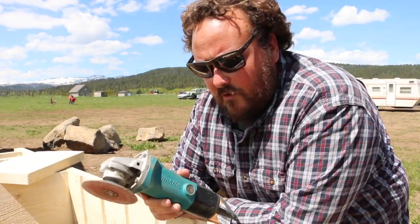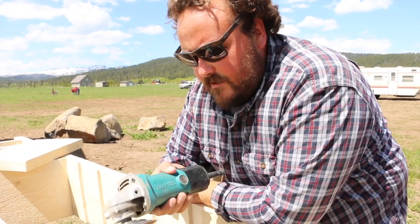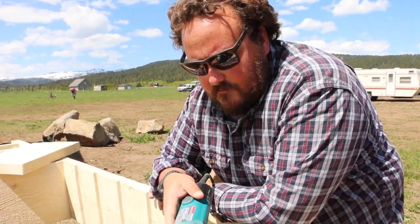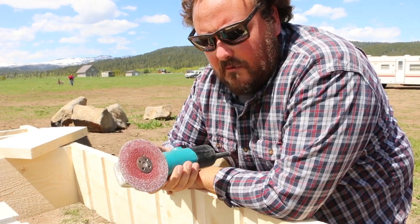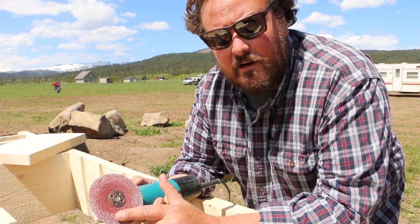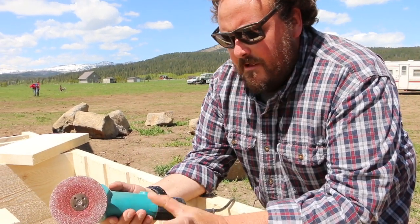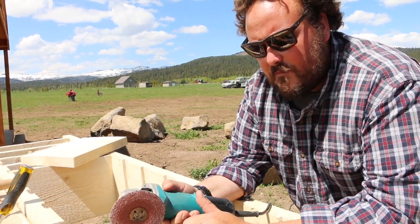Ladies and gentlemen, this is my secret weapon. This is a 4-inch angle grinder made by Makita. Now, it doesn't have to be Makita. DeWalt makes good ones. I don't have a sponsorship with anybody, but I have used Makita and DeWalt, and they are both great tools. What's unique about this is putting the 4-inch grinding pad on here. This is a 50 grit. What this lets me do is, where I may have crowns or knots or things that make it uneven, I can quickly sand those out of the board and get right back to putting things together.